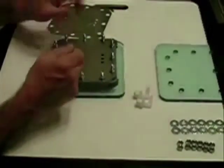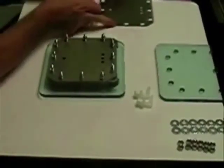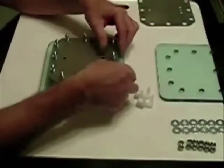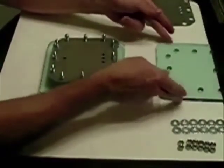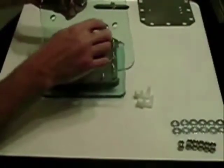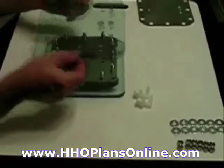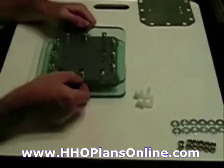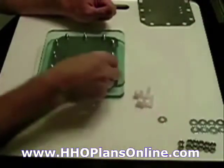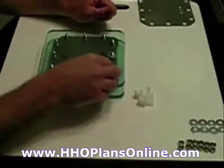It seemed to have done a fairly good job. I have a few extra plates here, but put that plate to the side. You end with a gasket just like you began with a gasket. Keeping the hole on this end at the top — remember the other one was at the bottom. That's for the fill-up; this is the exhaust side, where the gas is coming out. Come back and put washers — you can use lock washers, but I'm using small fender washers for now.